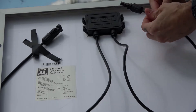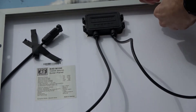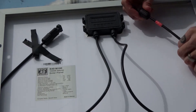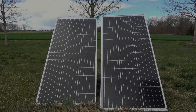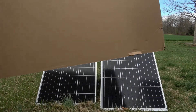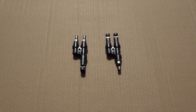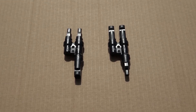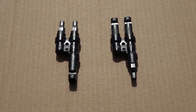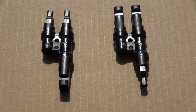The back of most solar panels are manufactured with a positive and negative cable extending from the junction box. These leads are typically labeled with the proper positive and negative indicators, but the male MC4 housing is typically the positive lead and the female MC4 housing is typically the negative. It's always a good idea to double check polarity with a multimeter, and once the polarity of the wires has been confirmed, you can label the positive wire with a piece of red tape. Before connecting any wires, cover the front of the solar panel so there's no live voltage in the system. These simple branched couplers are convenient for smaller systems and can handle up to 30 amps, but check the rating of any connector you use and make sure it can handle the increased current.